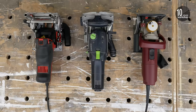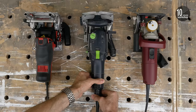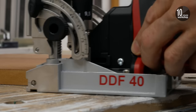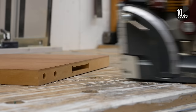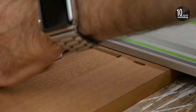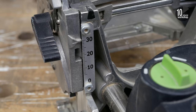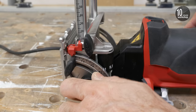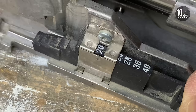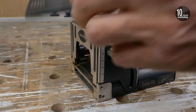In terms of layout, all three machines follow the same basic path, with an elongated body housing the motor, switchgear on top, power cable to the rear, and dust collection port at one side. Sat on their base, each machine puts a slot or holes at 10mm centres up from the base, and each can also be used for perpendicular plunges — for example, to put a fixed shelf in the middle of a carcass. The fence arrangement is broadly similar overall, with each machine having a drop-down fence with clickstops in the usual places. On the Festool and the Mafell, the fence is height adjustable and both come with height presets for common material thicknesses. On the Lamello, the drop-down fence is fixed, and height adjustment comes from an auxiliary fence that slides in place and locks smoothly, though you don't get any presets with that one.